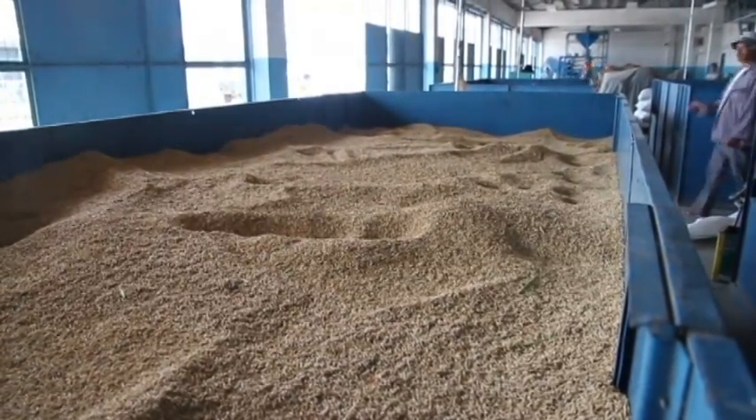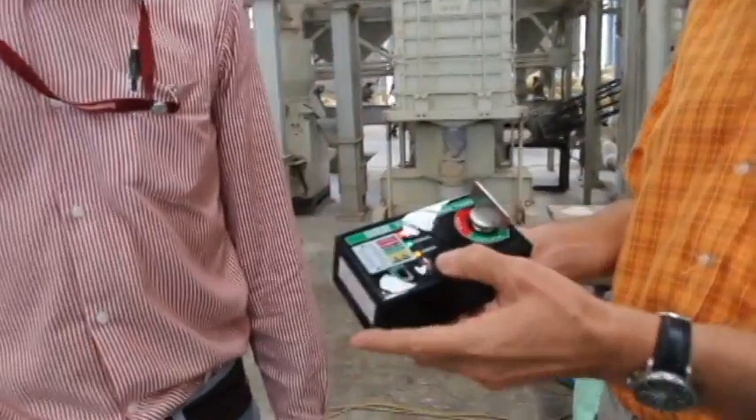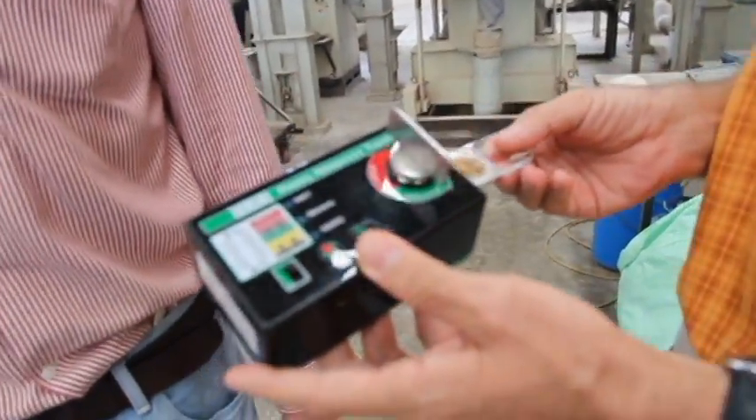Martin is going to measure the moisture content of a sample before our eyes, and hopefully it's what I claim it is. I can't actually measure the sample that has been in the mill, because it's already milled. But I have another sample here, and the ideal moisture content for milling is between 13 and 14%. The first step would basically be to measure the moisture content, and this is the ERI moisture meter.